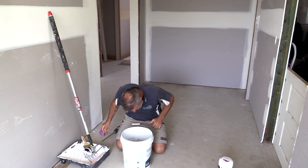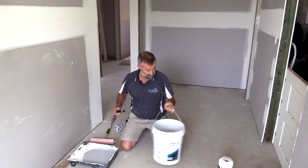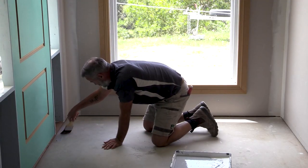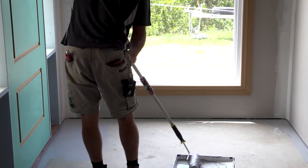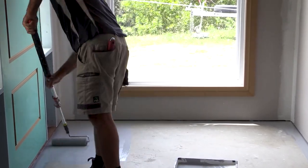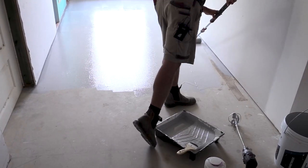Got that mixed up and I'm going to drop some in my paint roller. A normal paint brush is just for doing around the edges, any areas where you don't want the roller to bump up to. Applying this you want to put it on nice and thick - you don't want any pinholes in it - and sometimes it may even require two coats.